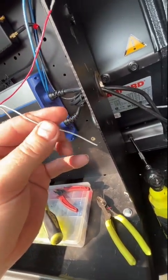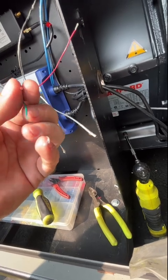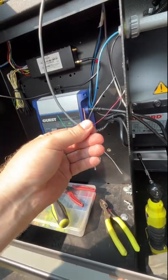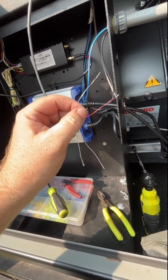So that's what's gonna go on that ADC wire, the green wire. It's gonna get connected to that after. These two wires here, the green and the brown, this is for actually how you interface with it through the RS485 adapter, through the software, which I'm going to show you how to use. So I'll just strip the end off of these just a little bit.